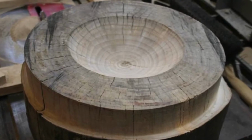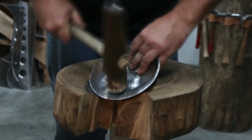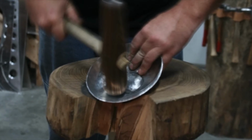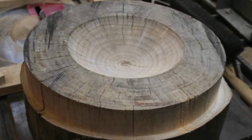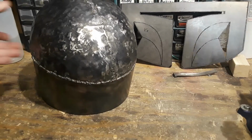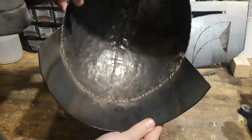So I made the dome by using a dishing stump. The idea of this is to get a flat piece of sheet metal and hammer it out so it will conform against the dish that is in the stump. This will give you the result of a metal dome. If you guys want to see how to make one, I will leave several videos about it in the description below. At this point, I decided to make the dome and weld the back plate to it.